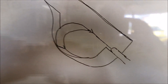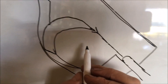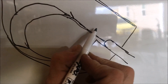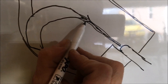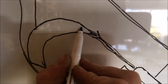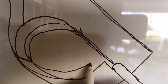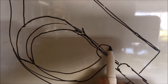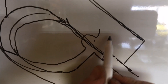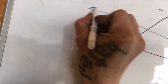We're going to try to illustrate what I think is happening and why this thing is working so effectively. Essentially, what we're doing is we're getting a jet of high-speed air and oil vapor that is hitting this swirler. What's happening is a fireball is traveling in this direction, going around that jet and simply avoiding it. There's no curve, but it's going around it and shooting straight out the device.